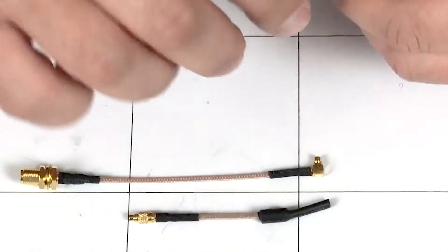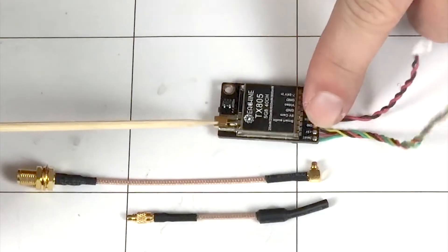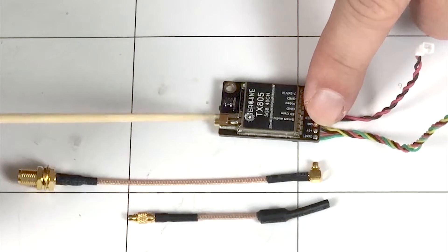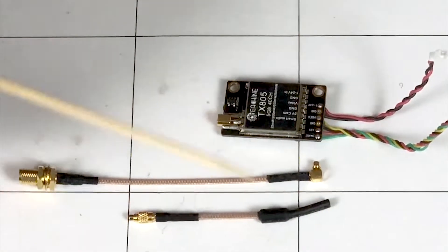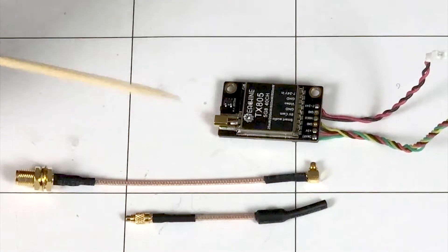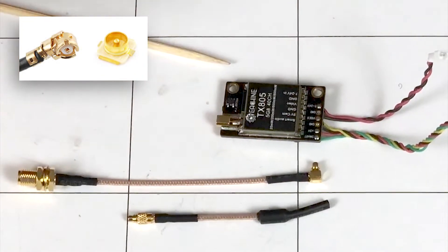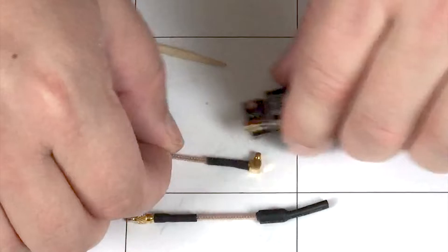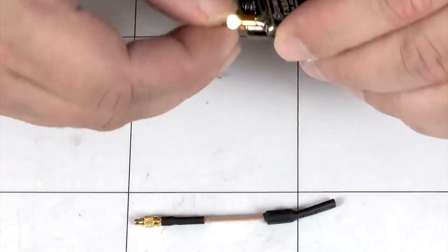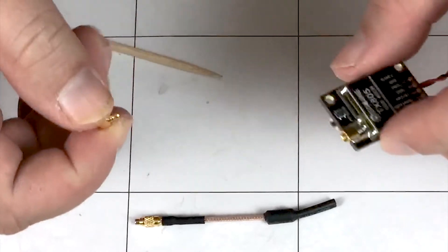The beauty of this, as I mentioned, is it has this MMCX connector. If you're not familiar, this is a really robust connector, and this is where I see a lot of the trend going now for antenna connectors. Typically they used to use what's called IPX or UFL — that little snap-on button you kind of push on to. What's nice about the MMCX connection is it's a good solid snap-in seating connection — you put it in, it's tough to push in, it clicks in and it's locked in. It's also tough to pull out once you have it locked in.